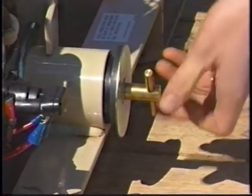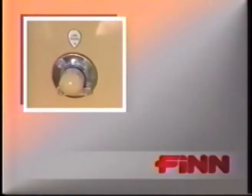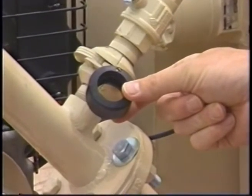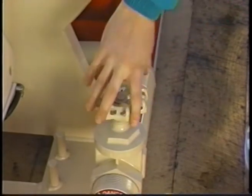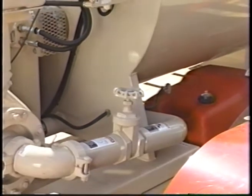Should you have any leaks from your system, do the following. Tank bearing leaks usually are the result of not being properly greased. The gaskets will need to be replaced. Also make sure the bolts are tightened properly at 25 foot pounds. At the pressure clamps, the rubber seal may have cracked, been pinched or sheared, and will need to be replaced. Remember to grease the seal before clamping shut. Leaks at the suction piping are the result of rubber seals being cracked or torn. They should be replaced and then properly greased before being clamped shut.